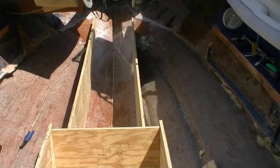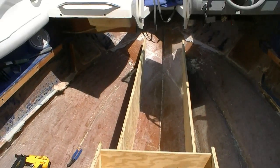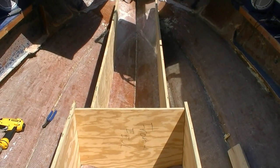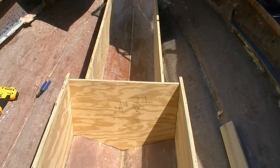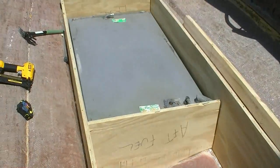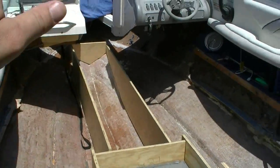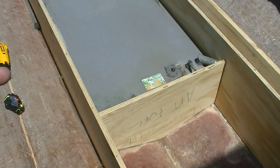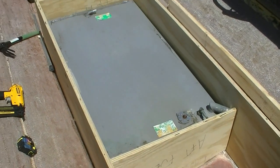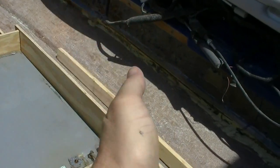I think the reason you're seeing light through it is because the gel coat on the outside wore off. I'll go back and re-gel coat it whenever we strengthen this up. Once that's done, we can wash this hull one more time, then bed all these guys into place, let them dry all week, and hopefully next weekend we can start glassing this stuff in. I had a little setback — nothing huge, but I'm glad I checked everything. Notice the bow of this boat is way up in the air. When I put in my bulkheads, I wasn't taking into account that they need to be basically perpendicular to the center line of the boat.